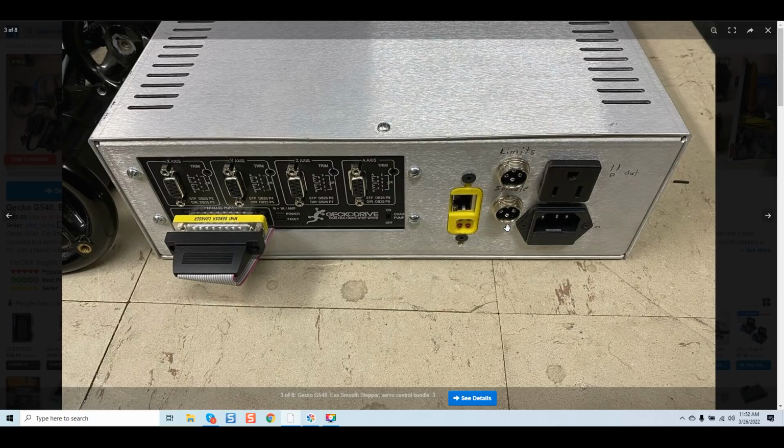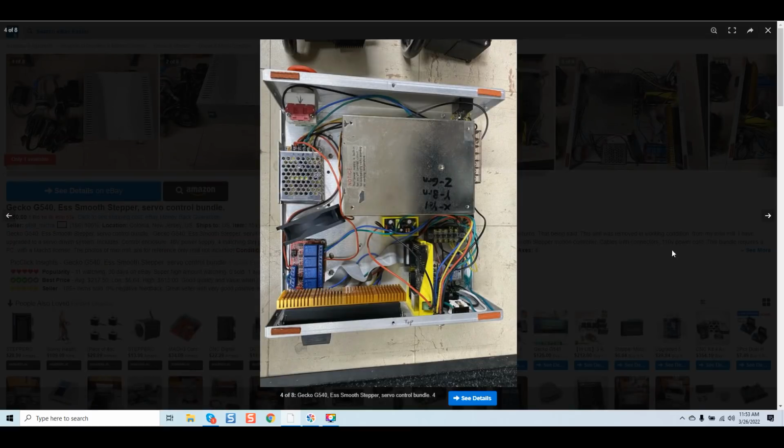He thinks everything here looks great. Okay, being he's got the ESS mounted inside the chassis, he's got the ribbon cable bent. Anybody dealing with PCs knows you don't bend around a 90-degree bend. We don't do that in best practice. Ribbon cables are supposed to have soft bends so they can transfer data properly. When you have them bent in a very, very obtrusive manner, you're going to potentially have data loss. So again, be very, very careful with these type of cables. Let's go inside the system now and take a peek.